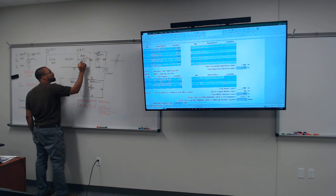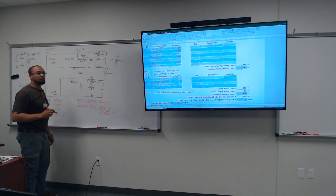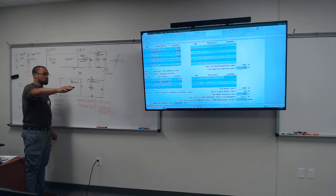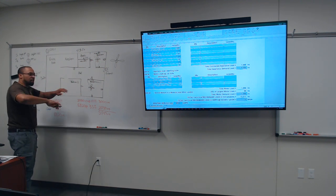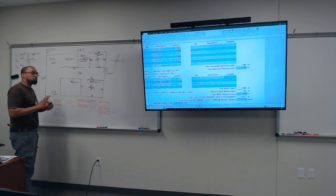All right, then I'm gonna put it in the laundry room. I'm gonna put it adjacent. Same thing, GFCI. Now this is separate from the outlet for the 240. He's talking about the 240. Yeah, for the laundry, we'll put that in there. It's gonna be separate. Yes, you do not want to put the laundry on the same GFCI, because that's just the 20 amp.